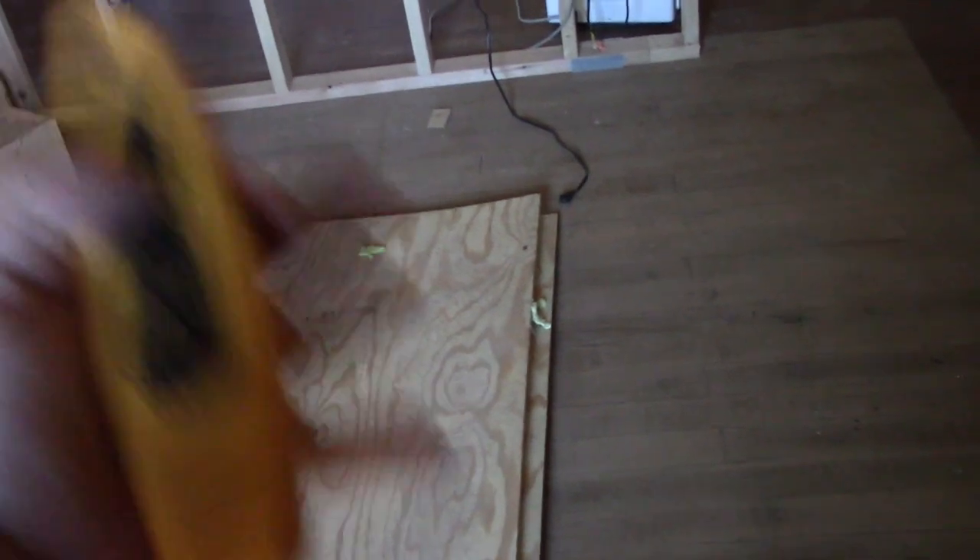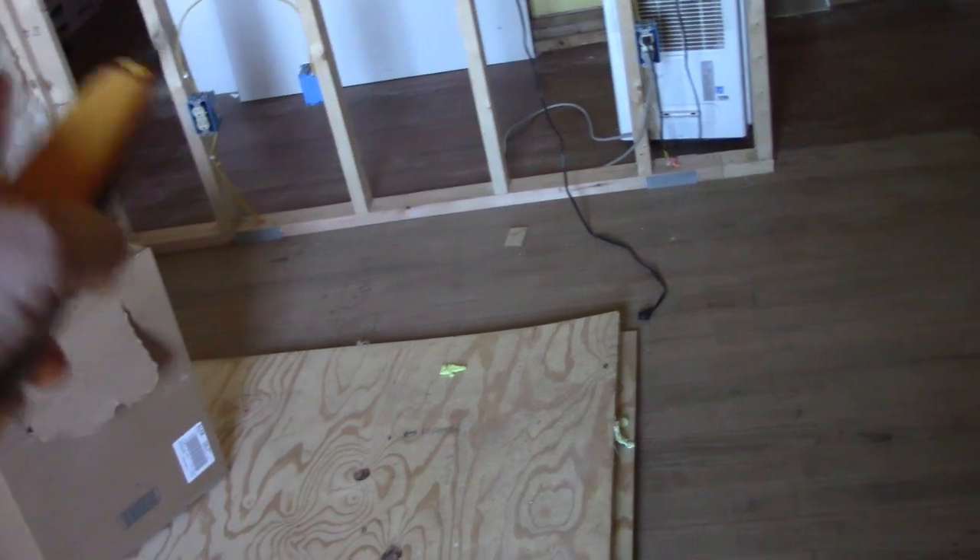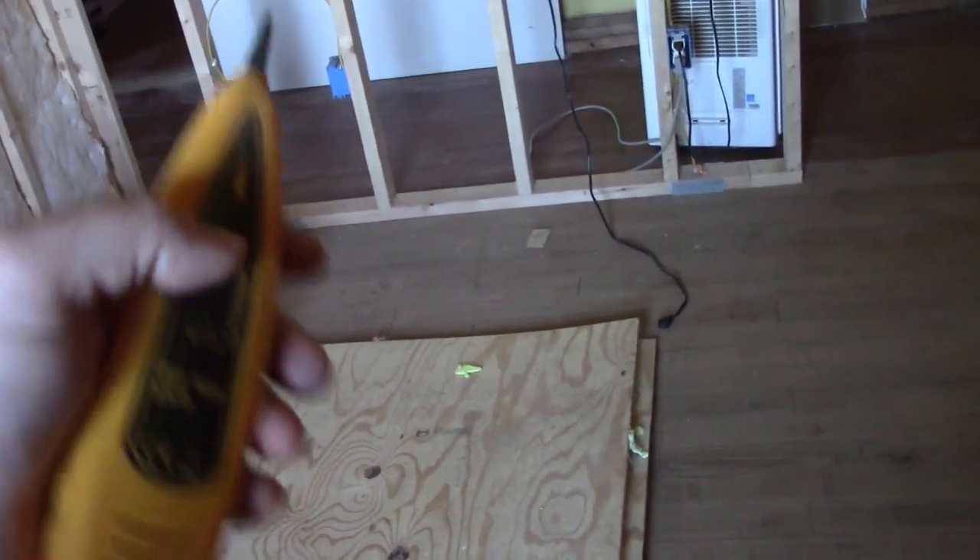These little cheap circuit tracer detectors have really come in handy, especially on this house trying to find the correct wire. All you do is make sure the circuit's dead from the box, connect to the outlet, and there's actually a pigtail adapter you can plug in — then you can easily find your wire in the house or up in the attic. Until next time, thanks for watching — please rate, comment, and subscribe. I'll leave a link to the one I purchased in the description; you don't have to buy that one, but it seems to work fine.